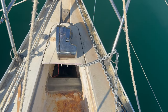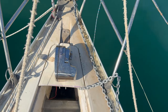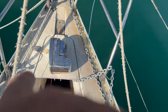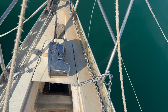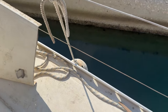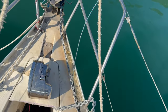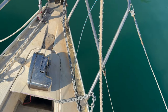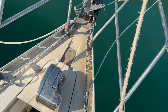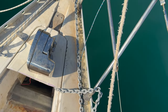It's dry fitted and there's nothing too bad, I don't think. I'm not worried about this cut at the front yet - I'm going to straighten that up. I'm going to put a bead across where the cut is to straighten it up, make it look a bit more presentable, and also stop rain getting in through there. Quite pleased with that so far.